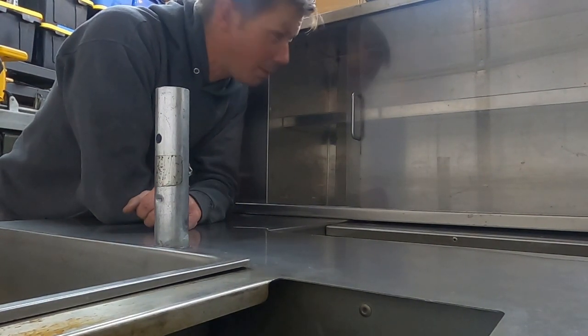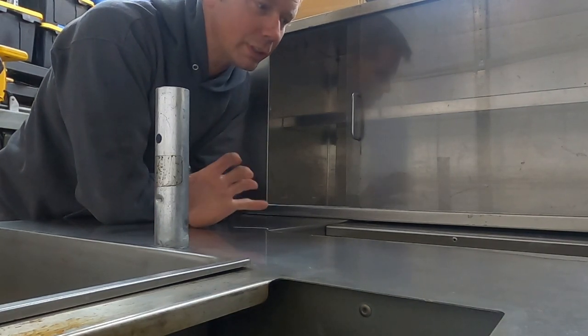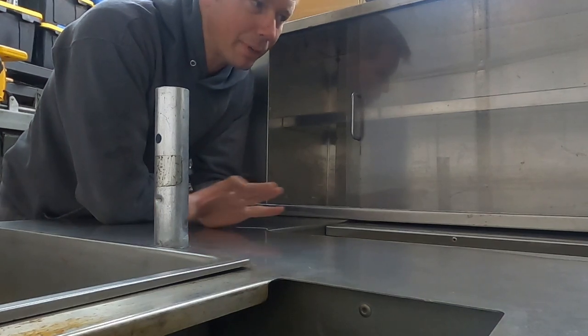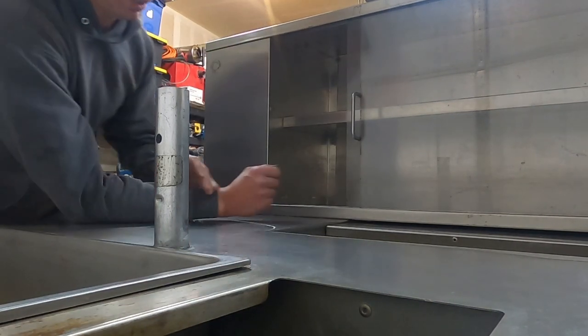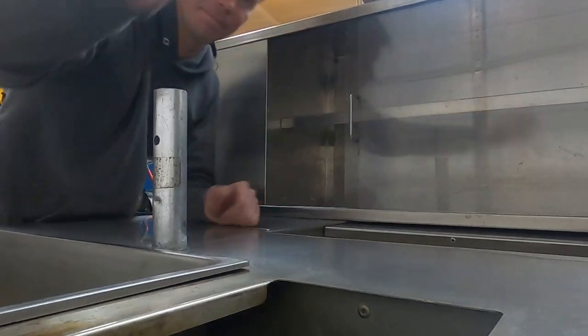It'd be nice to have some lights that tie into the batteries, but I don't want anything too intrusive, more of like a bit of a work light, but like a floodlight work light, more so than a spotlight. So what I think I'm gonna do is, up in here, on an angle back on this wall here, we'll install just a couple little tabs, and then there are these quad LED lights that I have in my camper that are really nice, and they're really low amp draw, and we'll just throw a couple of those in up here, and then we'll put the switch down here by the water pump switch and our battery monitor that we installed last time.